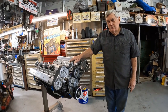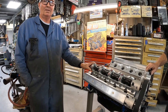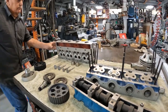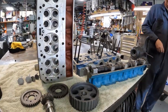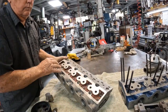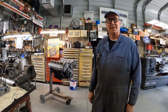These could potentially run in the 9,000 RPM range — with good crank, rods, pistons, and everything balanced. Some of the design challenges: the valves of the day were all 11/32nds and we put seven-millimeter valves in this one. I basically had to take the stock part and recreate it three-dimensionally on the CNC — trying to make it as light as possible, sculpting it out to get the weight down. The first engine in Cal's car was already fully ported; this one here we ported ourselves, so we'll see what the difference is.